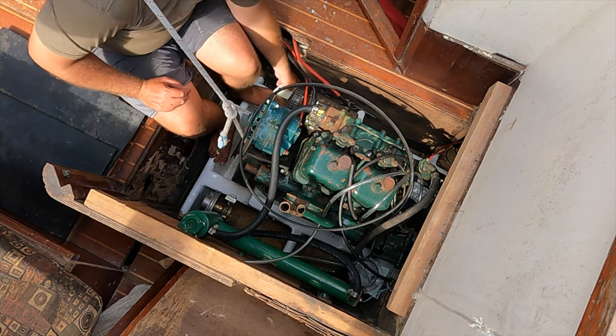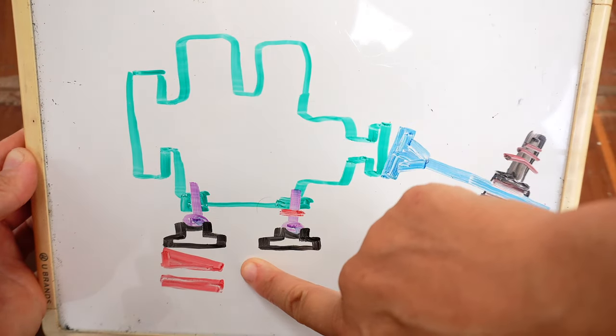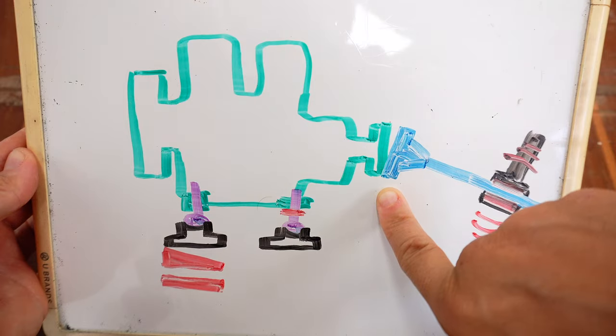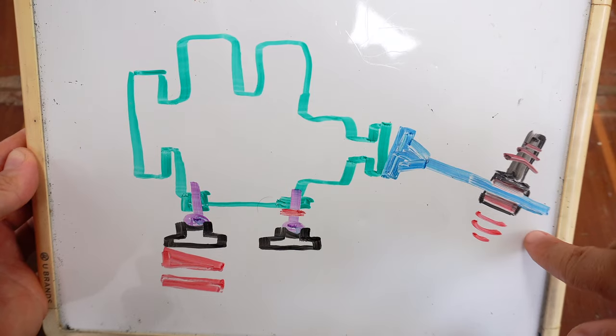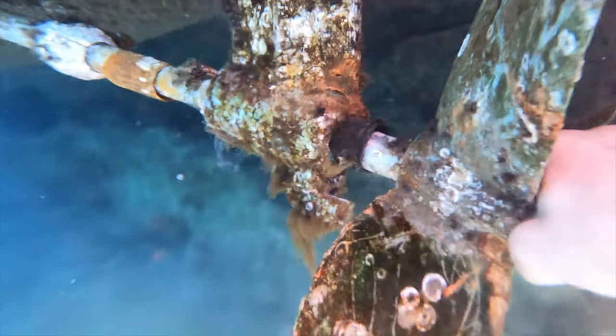My little wedge plan did not work out. I even made a second layer of G10 to place under the first wedges, but it was simply not working to bring the faces of the couplers into alignment. Not only did the front of the engine need to come up even more — way more than I could simply haphazardly wedge it up — but also the cutlass bearing which holds the entire end of the shaft in place is completely worn out, and the shaft simply wobbles around way too much for any meaningful engine alignment to be made. So it's going to be impossible to do anything to get this engine running until the boat comes out of the water, for several reasons. We're struggling to get an outboard engine now, something temporary to get the boat to the boatyard. Wish us luck.